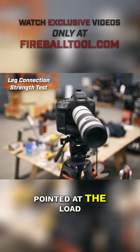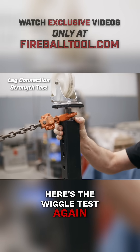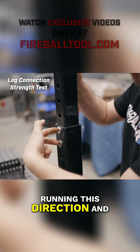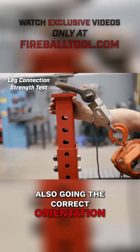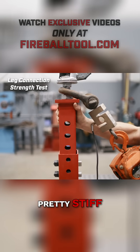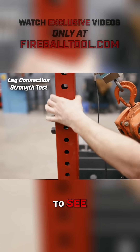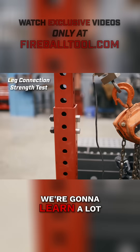We've got GoPros looking at the connections so we can see if something's moving, and a camera pointed at the load cell so we can see how much force we're applying. Before we get started, here's the wiggle test again, all isolated from the table. Quite a bit of movement there. I got the pins running this direction, and on the Fireball table the pins are also going the correct orientation. Look at the movement — or lack thereof. Zero. Pretty stiff. This is going to be an interesting comparison between the two fastening points and these pin connections to see, at the end of this, does this still telescope? Same with that little leg over there. We're going to learn a lot.